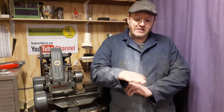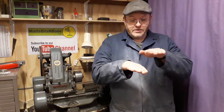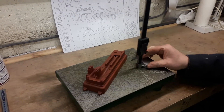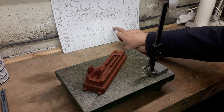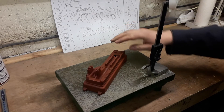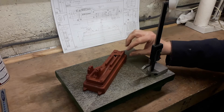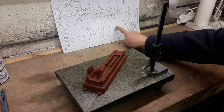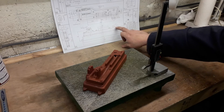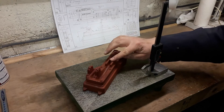In this you'll see the machining. There's one critical measurement, which is basically between the machining of where the cylinder goes and where the slide rails are, which is 21/64ths. We'll cover how to get that accurately. When you convert 21/64ths to decimal that's 0.3281 — that's the difference between that machined face and that machined face.